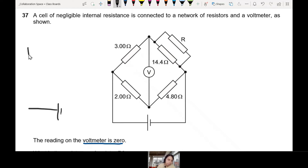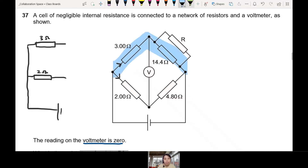We go up to a junction and split into two paths — one goes up, one goes down. I can redraw it like this: one resistor on the top path, which is my 3 ohm, and another path on the bottom, which is my 2 ohm. There are two paths already. Then this voltmeter will bridge between the two paths — one path up here, one path down here. So it's like a bridge. This is what I call a bridge question. The voltmeter is bridging and measuring the difference across.